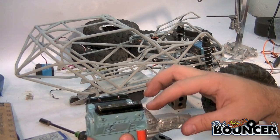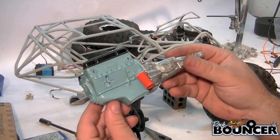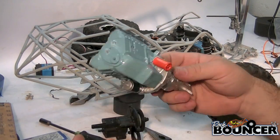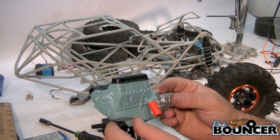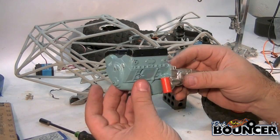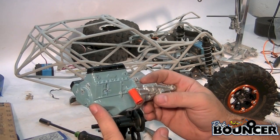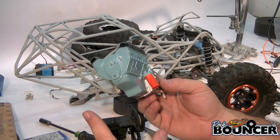And then I might even, when I'm in there trying to make that top end look like what I want, I might use it to house like my ESC, BEC, receiver, things like that, just to fully utilize that space and turn it into like my receiver box. I'll be welding on some tabs to the chassis to come up and support the motor, and then I'll be building headers, which I'm guessing I'm going to be building out of brass. I think that'll be the easiest way to do that, and I'll be able to get the best bends.